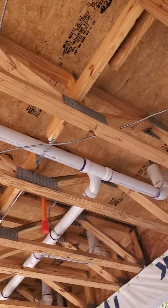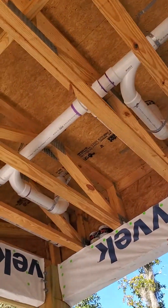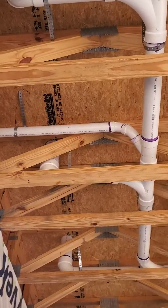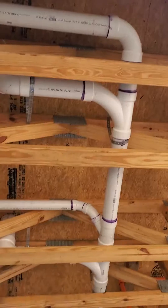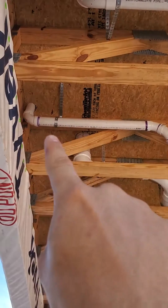Right here is our toilet line. I've got three toilets right next to each other — toilet number one, toilet number two. In between is a dry vent, just to make sure the toilets don't gurgle and they have proper airflow. Technically you can run them without, but I don't like doing that. That fitting right there is a dry vent that comes over and will go up.